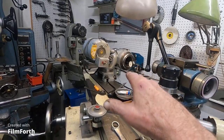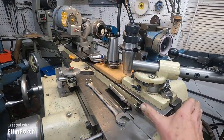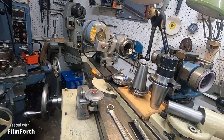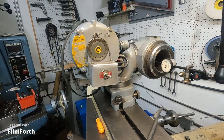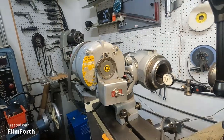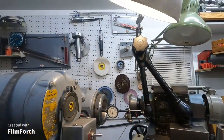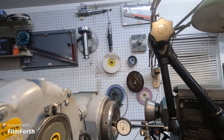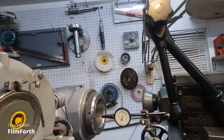This is how I set that up to grind if I need to. I've got the top of the table angled over, which causes a straight surface for the indicator to ride on. I kicked in the slow feed and it just seems to be pretty good.